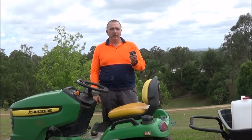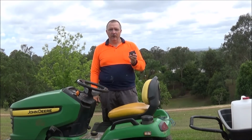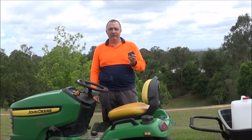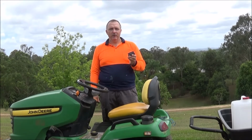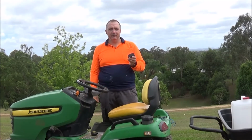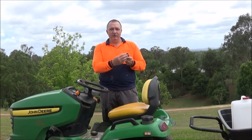You may be wondering why I'm placing so much emphasis on the on and off switch. It is to conserve chemical spray. Janauskas Farm is very hilly and the mower is old. So old in fact it cannot make it up every hill on the farm. That means it may be necessary to drive over some parts that have already been sprayed. When this occurs, the driver can simply turn the pump off to conserve spray. Now let's start making the rig.